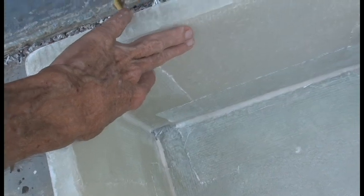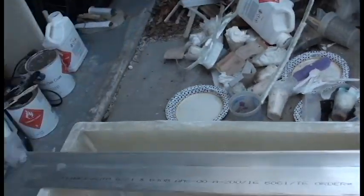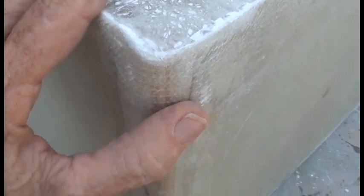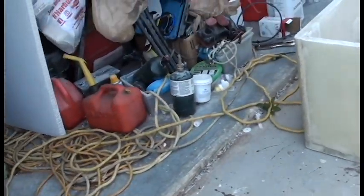I glued the panels together with thickened polyester resin, and I've added some more fiberglass cloth tabbing that comes out about 4 inches on each side of each corner. Before laying in the tabbing, I rounded the inside corners with fairing compound so the tabbing could go around a curve instead of a sharp angle, and the outside corners have half-inch quarter-round molding inlaid into the corners.